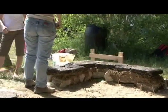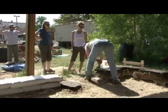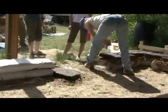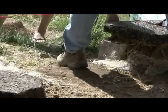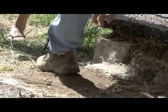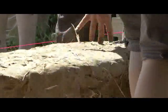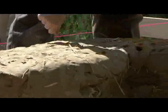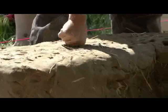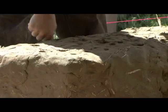You can do that all the time — you don't have to do a layer and wait for it to dry. We could come down over and meet our cob that's underneath so that all we see in the end is our urbanite. In that case, we might want to re-wet this just a little bit so that it will bond. If you want to keep going, you need to put some botanical bond in there — straw. You knit it in, or find some sort of small stick and knit it in some more. You really want to work it in.